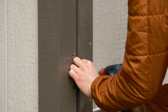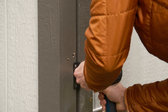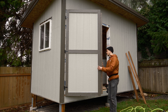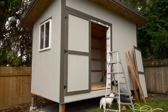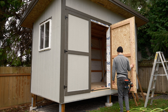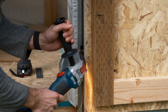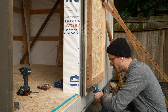To install the hinges, I used a self-centering drill bit and some stainless steel screws that were long enough to go through and connect to the framing on the inside. That crinkling sound is actually a result of those screws being a little bit too long and puncturing the house wrap on the other side. This felt like a huge milestone — having two doors that I didn't have to carry and that didn't blow off in the wind randomly. As usual, Anne was my assistant on the inside, helping me shim these doors into place. I quickly addressed the screw length problem and took a sliver of siding off the right side door to fix some binding that was happening when the door was closed.